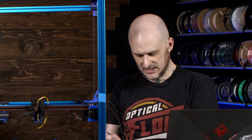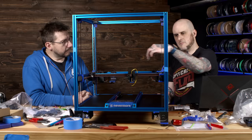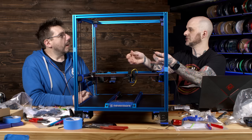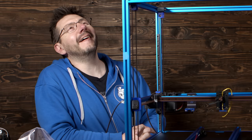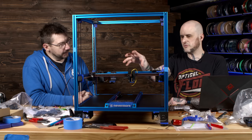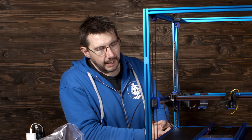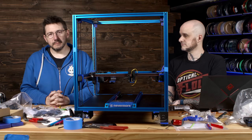We've got a tool head PCB here that's going to mount to the side of the extruder assembly, to make it so everything on the tool head, wiring wise, goes to this PCB and there's only one connection back to the... Oh, so you're not having to home run a bunch of cables back through a chain. Exactly. If we need to service anything here, it's easy to disassemble and not have wires dangling all over the place. That's cool. They included the hardware and the switch and everything we need for the clicky probe. Aside from the printed parts, of course, everything else has been here that we need for this project. I guess I've got an electronics box to build and you've got a print head to make. Yep. All right, let's do it.